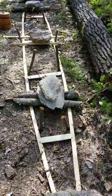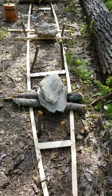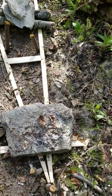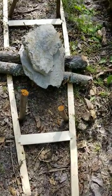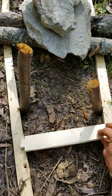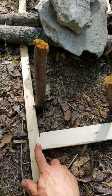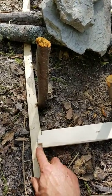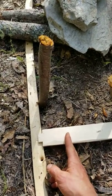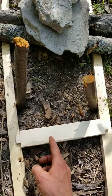For the frame, the chines are about three-quarter by one and a quarter inch. What I have here are one and a quarter by two inch splits that I'm carving out, and as you can see, they're going to be mortised into the chines. They're going to pass through each of the other frame pieces.